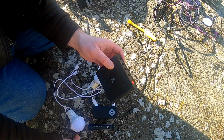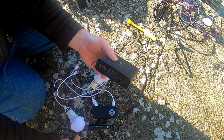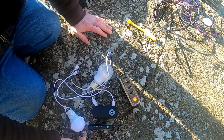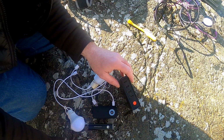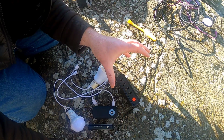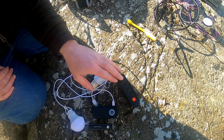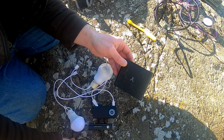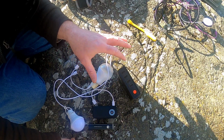Given the size of the capacity of the battery, quite often, even if I take them out on a weekend and use them, I'm not hitting the battery hard and I'm not drawing it down to a depleted state normally. So the battery's life tends to extend, because the cycles I'm putting on them aren't hard, and I'm not cycling them from dead to full every day. There's enough capacity that, with the power use I do, and I'm very conservative about my power use when I'm around camp, I can normally get 2 to 3 nights out of these, even if I wasn't plugged into a solar panel at all. Generally speaking, that would only be 1 cycle over 3 days, going all the way to dead and then charging it all back up again. So you can really extend the life cycle of these just by being gentle with them. But I'll shift camera angles and set this stuff up so you guys can see it functioning.